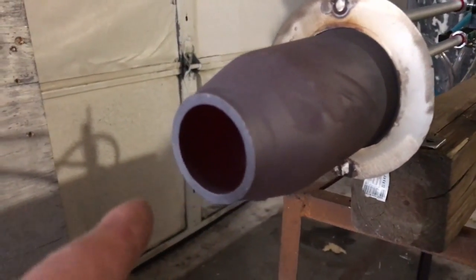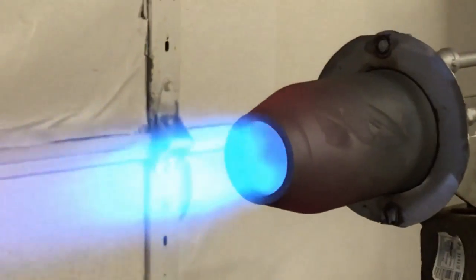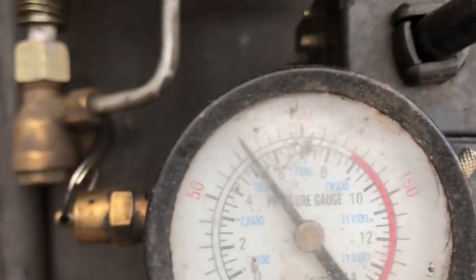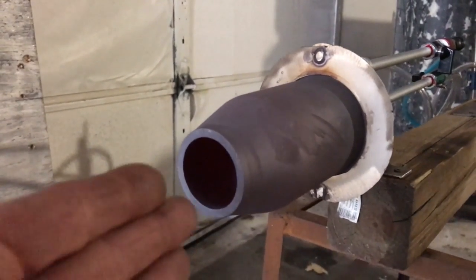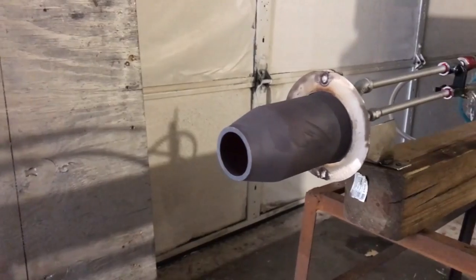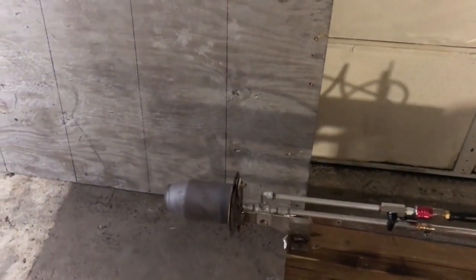I can say this — there is an amazing toroidal fireball just behind this nozzle. See that blue ring in there? It's kind of hard to see it, but it's there. You can feel it with your fingers too. When you run the unit with just the air on and put your hand inside of there, you can feel it. There is definitely an extreme stability of flame going on here — I would imagine you can't blow this thing out. I hope that gives a pretty good idea of the operating parameters. We're going to try this on a bigger air compressor next.